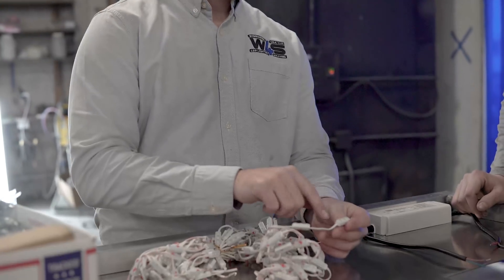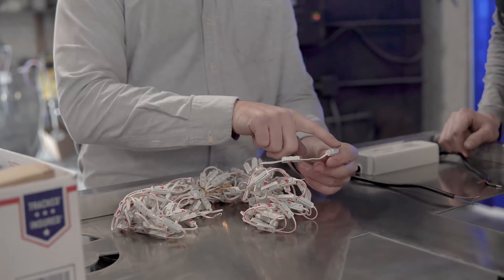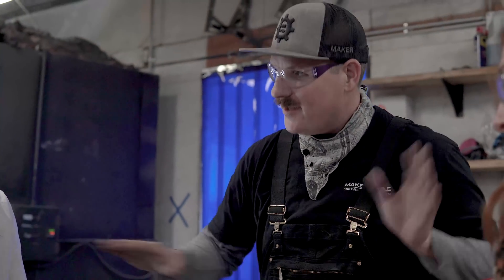Is that like three lights on there? That's correct — three LED chips. And you'll see there's a domed lens that gives you a 160-degree beam spread, which is very wide. It also helps reduce hot spots and makes them blend together, so you don't have shadows in between. You can't tell these are modules — it'll look like continuous, uniform light throughout, which is what you want.